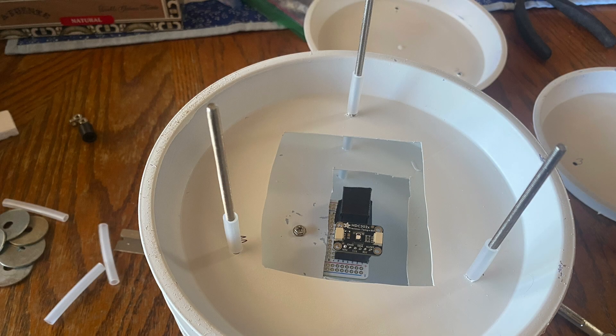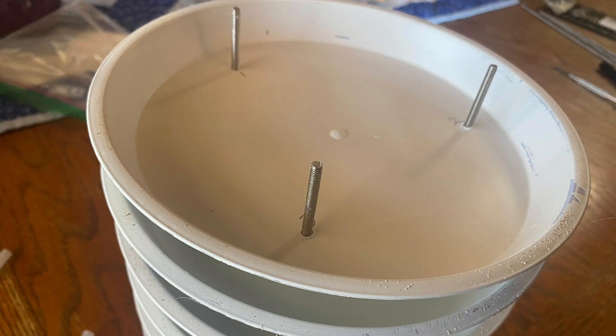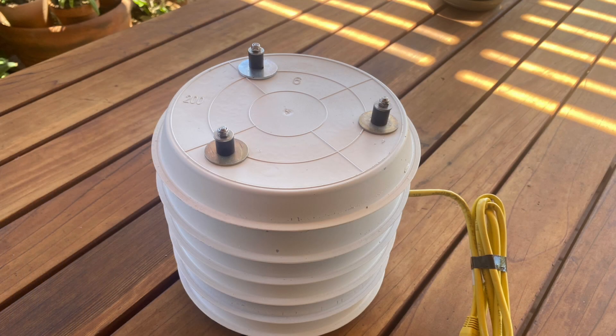The temperature-humidity sensor is being isolated with a small scrap of packing styrofoam. I added some space around the mounted sensor on the next stacked plate to avoid bias in my readings. In retrospect, I could have probably modified a few additional plates to further minimize bias — something I'll keep in mind for a model I'm putting together for an independent study project in SolidWorks. Here are all the plates stacked and spaced neatly via the threaded rods, and here's the completed radiation shield coming in at about $30, not including the protoboard, sensor, and ethernet cable, all of which I had in my surplus bins.